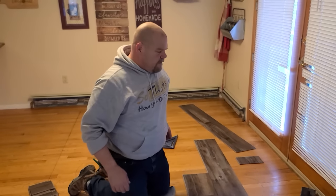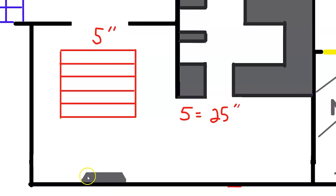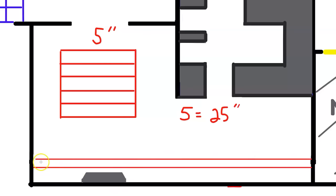Let me stop and explain what's going on. In this video I have the fireplace here, and I'm starting the plank out in front of it — away from the wall — so I can get at least one row installed and get a good solid foundation without worrying about cutting around the fireplace, scribing to the wall, or miscutting things. It's so much easier to leave out at least one row or come out in front of something like this fireplace, then start, and later when the installation is done, come back and easily install those rows into place.